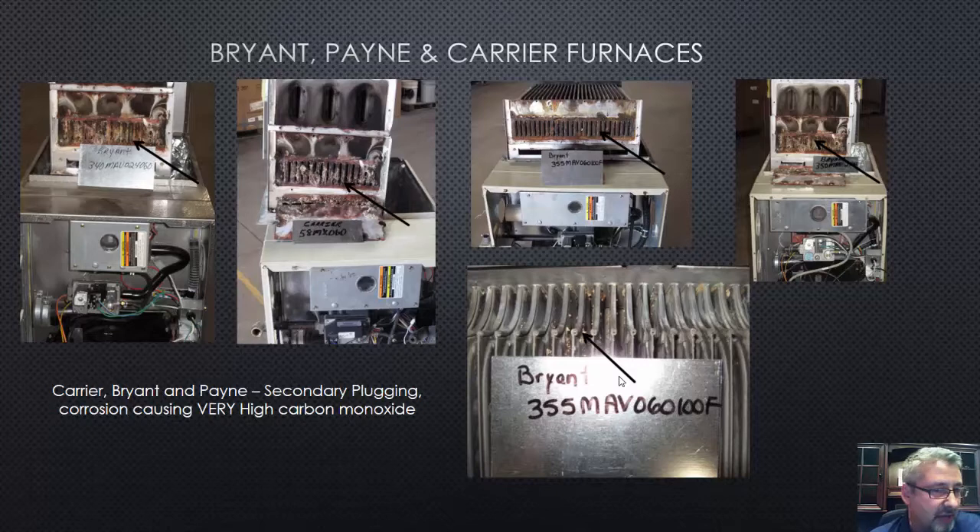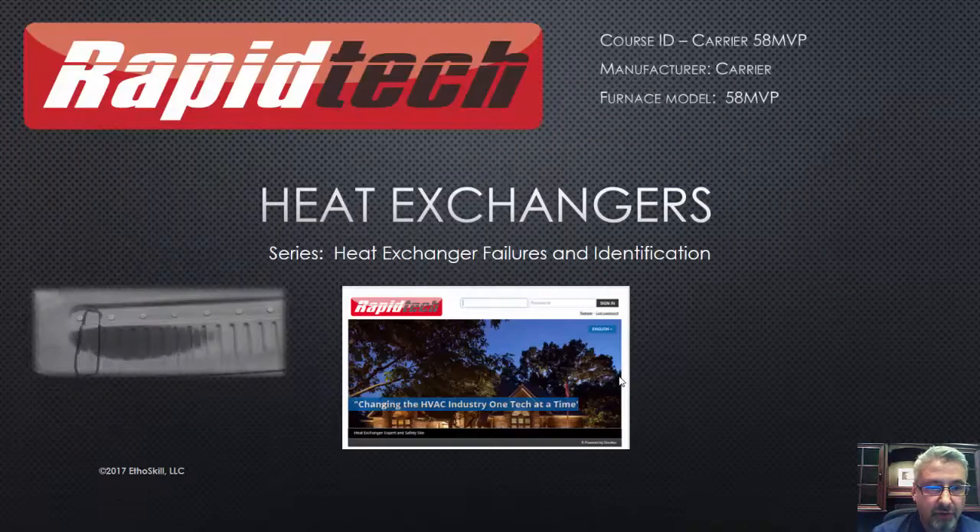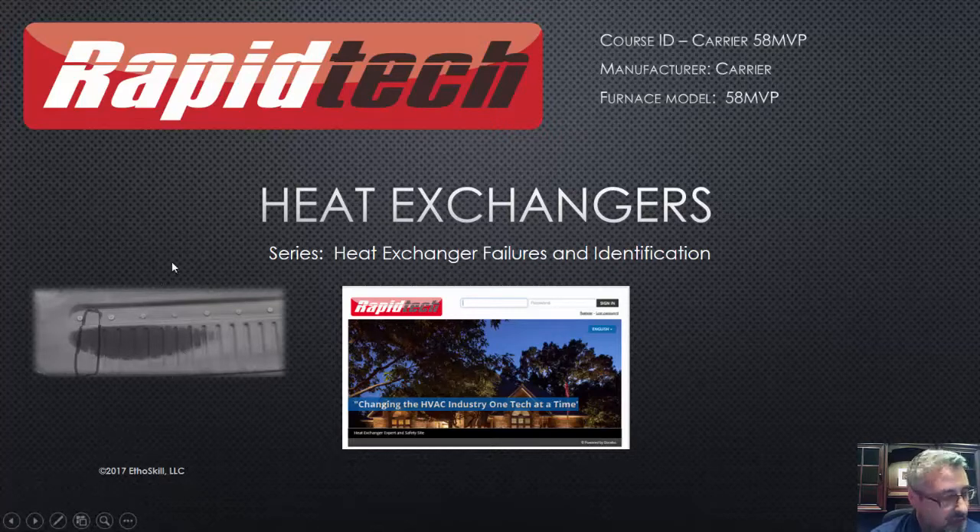This is the washboard — see that? This heat exchanger is in our possession; we took it out of a Bryant furnace. Where I circled it with a Sharpie, there's a fracture right here on the washboard and you can see the heat stress. These are the rivets. Any time you inspect a Bryant or Carrier — the 58 MVP, Bryant 355 MEV, MXA, 350, 340, MCA — any of those 40-inch models, you want to check these rivets for fractures.